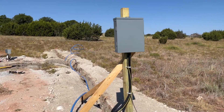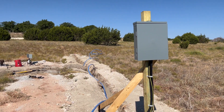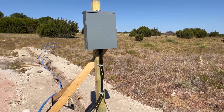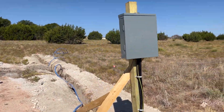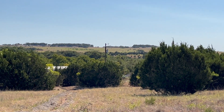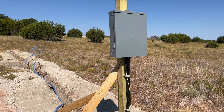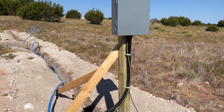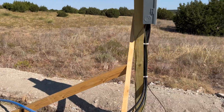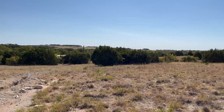Here's where the power terminates. We don't have any buildings up here right now, so we were running kind of off schedule — we really needed to get power to the well but weren't ready to finance a building. Power comes from that pole down there, about 350 feet away. What we learned was we needed 350 MCM power cable, which is not cheap. We could have gone aerial but really didn't want another pole up here near where the house will be. It does have a pretty nice view — this is Central Texas and it has its own beauty.